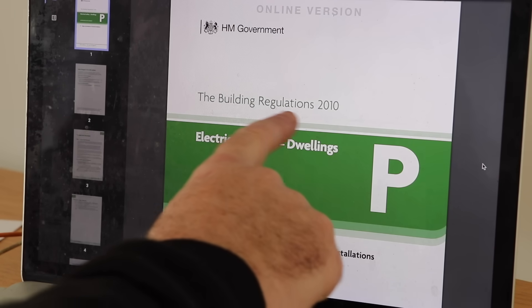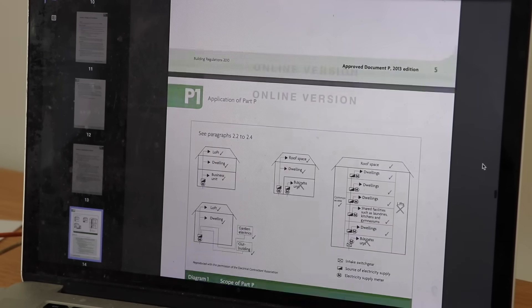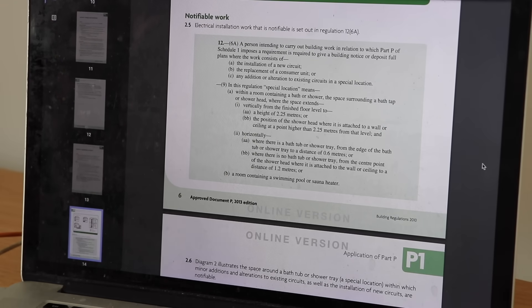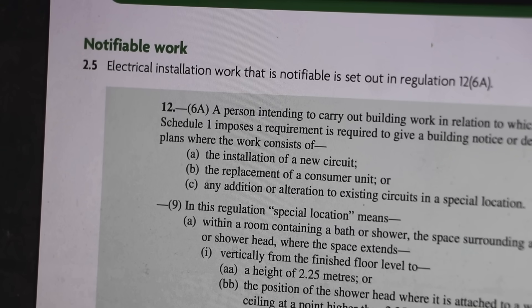So what are we as homeowners allowed to do within the electrical systems of our own homes? There's a document that gives all the answers — it's called Part P of the UK Building Regulations 2010, and I've put a link to it in the description below. This document describes what you can and can't do in your own home depending on whether the work is called 'notifiable.' These regulations are applicable to England and Wales only, so if you're in Scotland the rules might be slightly different. If the work is notifiable, it needs to be notified to the Building Control Authority, which means a DIYer or non-qualified electrician can't legally carry out the work. If you do, you risk a fine of up to £5,000, and more importantly most insurance companies won't pay out on any claims, and when you come to sell the property you could have a problem proving the installations were done properly.